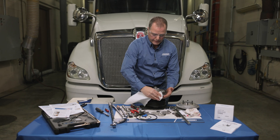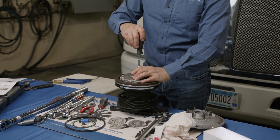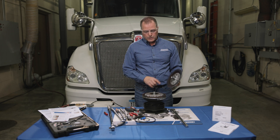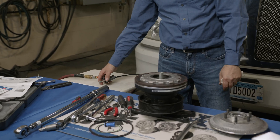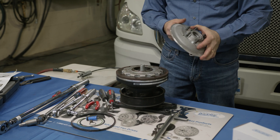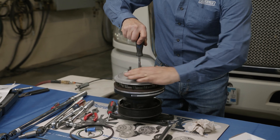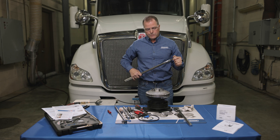Now, make sure we clean the friction material off in case we got any dirt or grease on there, and then remove our cage nut. Now we're ready to reassemble the fan mounting disc onto the clutch. But first, we have to apply air pressure to the back — I've put an airline in the back here with air pressure applied. This will assure that you get the proper torque on the jack bolt when putting the fan mounting disc back on. Spin it on by hand, then take your foot-pound torque wrench and torque this to 100 foot-pounds.